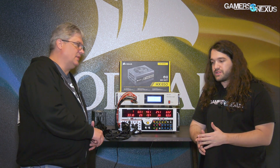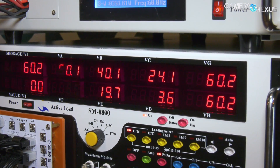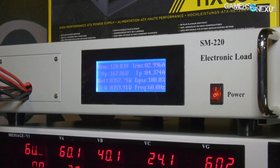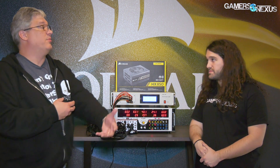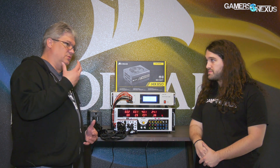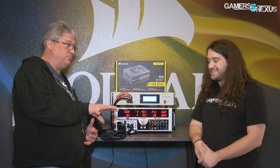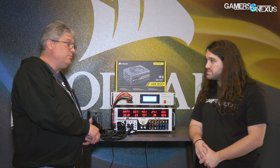Where do we classify exceptionally good ripple versus acceptable versus unacceptable? Personally, I find acceptable for a typical end user to be around 60 millivolts. 20 millivolts is usually the goal for Corsair, partly because it reviews well, and also because we sponsor a lot of overclockers — even ones we don't sponsor will use Corsair power supplies at shows because the PSU is not part of the equation causing overclocking problems. Something like the AXi, for example, targets 15 millivolts by spec. So really, a good power supply should be around 20 millivolts.